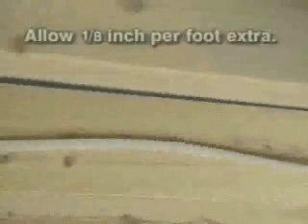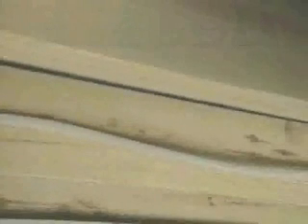This gives plenty of slack so the tubing won't pull on the joints as it contracts when the weather gets cold. On long runs, this slack can be built in via either loops or S-bends with a 12-inch offset.